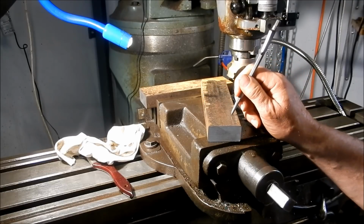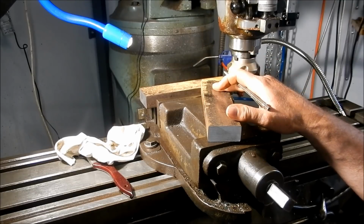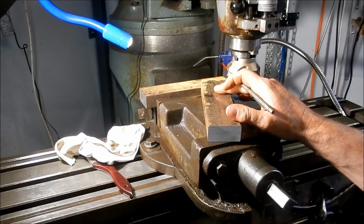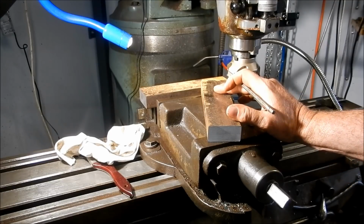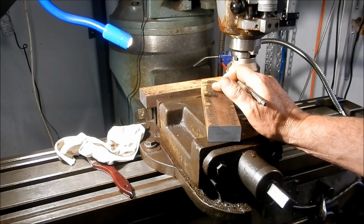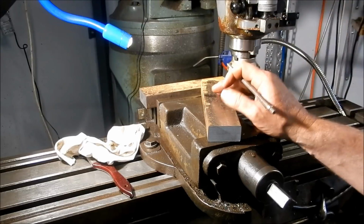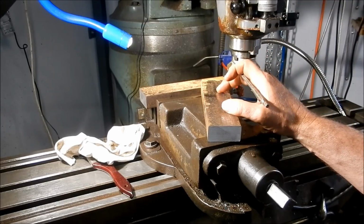Something I did want to talk about is the stresses that materials, when they've gone through a hot work process, tend to hold. This has been put through a hot rolling mill, and after the final rolling process, it flies out usually into a big cooling A-frame, which has got air at a fair rate coming up through a series of grids that this stock is sitting on.